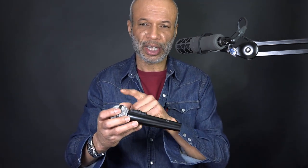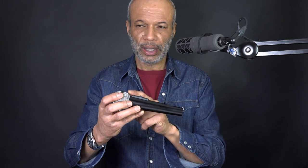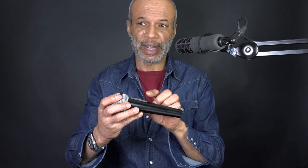These are very difficult to come by. The first one came from Germany, advertised fair condition, working — good seller from what I could see, a microphone person. The switch wasn't working. These switches not working is something I've noticed a few times. They're magnetic reed switches that Beyer Dynamic used, and I think they can deteriorate. You turn this and there's a magnet in it, and in a glass container filled with an inert gas there are two metal reeds, and when you turn the switch it creates a contact.